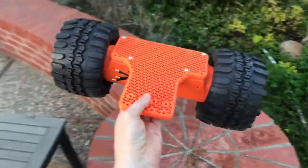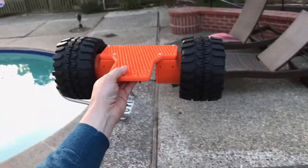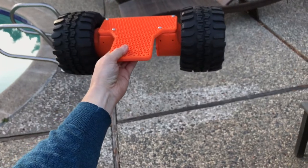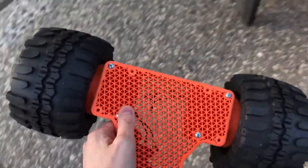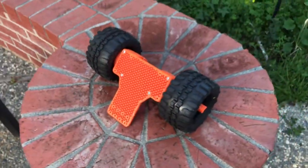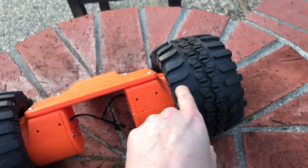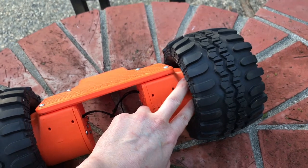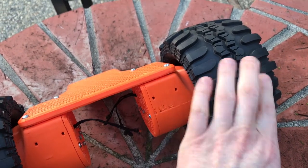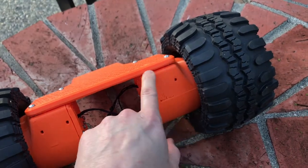We can do one more thing here. It's a little hard to see, but that's four feet in the air — and this thing just doesn't care about that. It's durable. The way that works is that the forces going into this wheel transfer into a shaft that is pretty short, and it's coupled into two bearings that are mounted here. So the shaft is cantilevered out, but it's very short, so the force goes from the wheel into the shaft, straight into these bearings here, and then that transfers up into the frame.